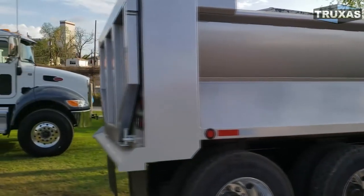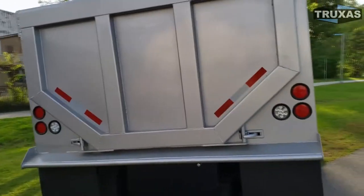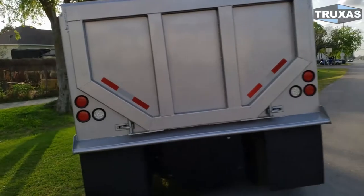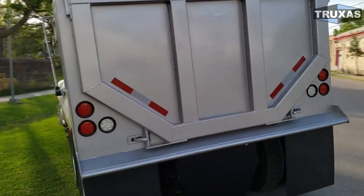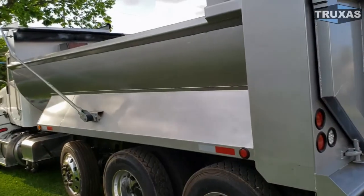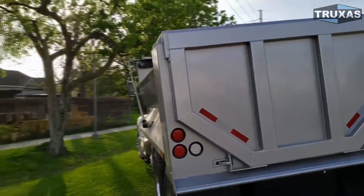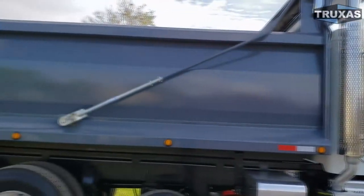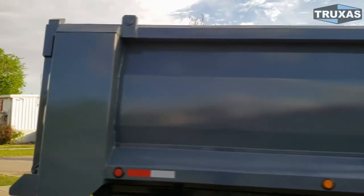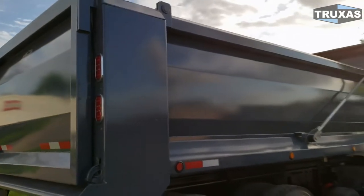The main difference between the two beds is the Boulder Lane is a complete half-round dump body. Inside, that is a half pipe that's 48 inches deep — that's the standard depth. The Load Lane here is a square body, basically square. You can see on the sides there are some bends, so there's kind of a little bubble there in the center of the bed.